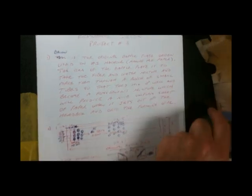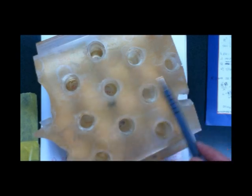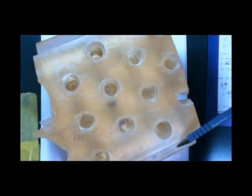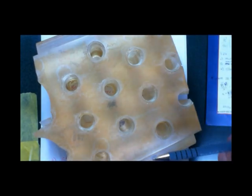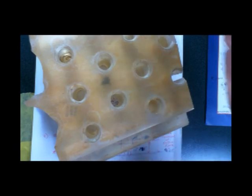I have a series of videos that you're going to watch that explain a little bit more about how paper is made, or at least how paper is made in a continuous sheet. The original baffle plate — I do have a piece of it right here — I'm just going to slide it into the screen. This is a picture of a section of the original baffle plate. This baffle plate was 112 and a half inches long this way on the raised part, and the side support areas were 114 and a half inches. The distance across the raised part from edge to edge is six inches, and from one edge to the other edge it is eight inches in width.